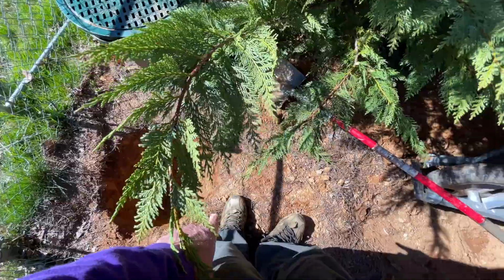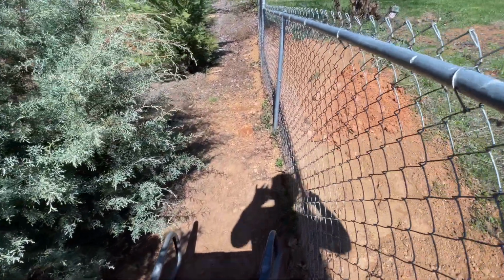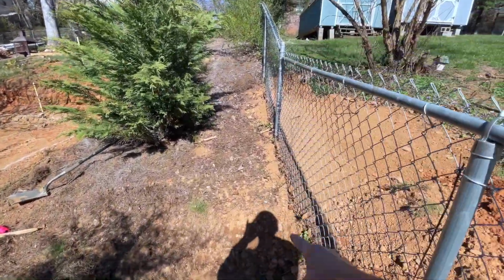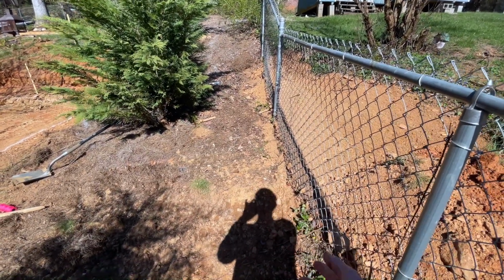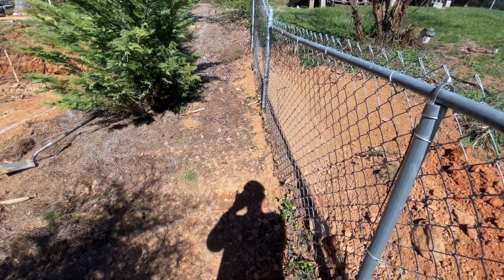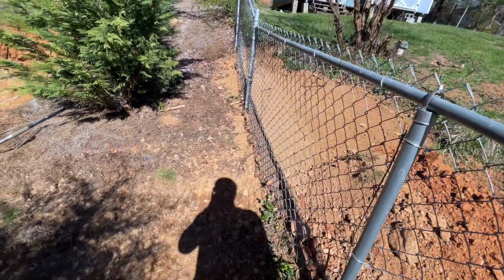And then we're gonna take here, I'm gonna dig down a foot, and we're gonna put a French drain, and then that goes from the top here all the way down. And then we're going to put a riverbed in there. So it'll come down in the riverbed, drain into the French drain, into the box, and any excess because of this hill will go into the box.